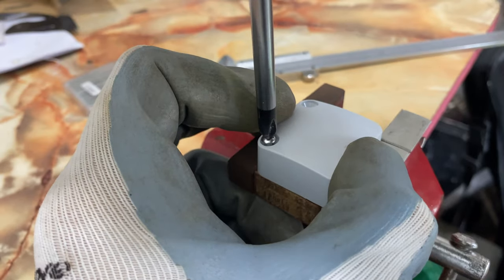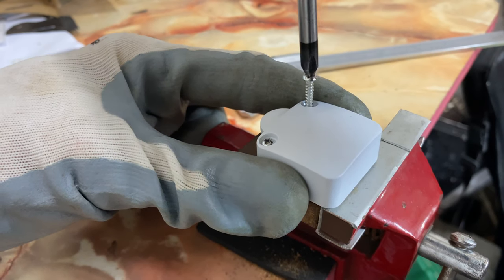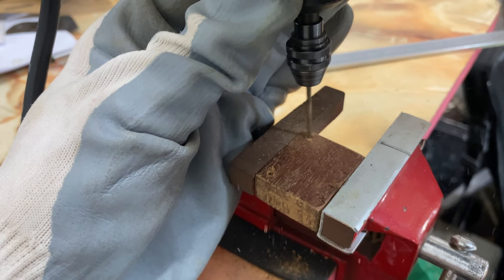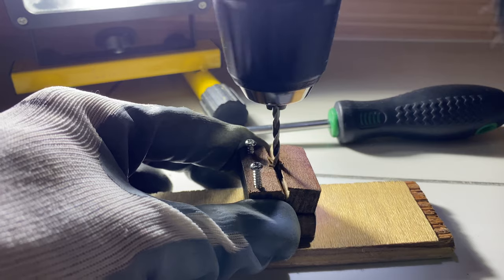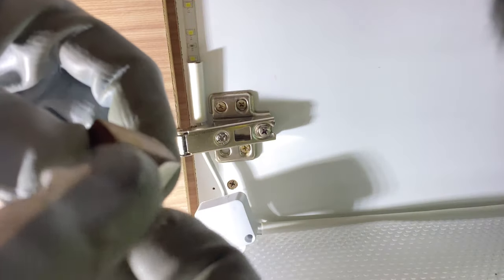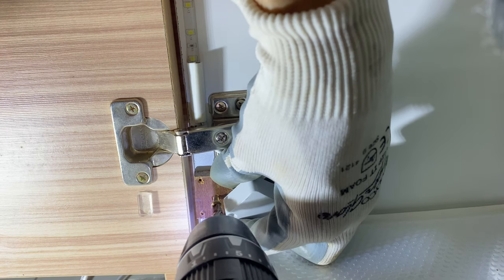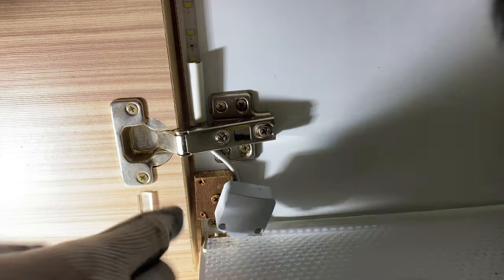Next, I make a marking so I know where to mount my switch. I've made one pilot hole earlier — next I need to make a marking and make sure my drill bit is 1mm smaller than the screw. Make the pilot hole and then the non-pilot hole for the mounting. I used the template from the previous cracked one, made an M3 pilot hole, applied double-sided tape, and stuck it into place. Using an M4 nut this time — it works! Finally it doesn't break. The moral of the story: the pilot hole must be 1mm smaller.